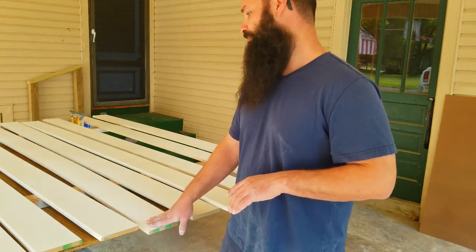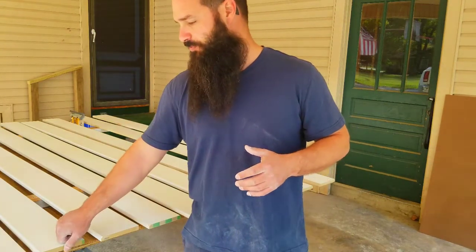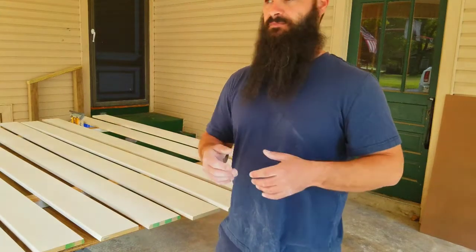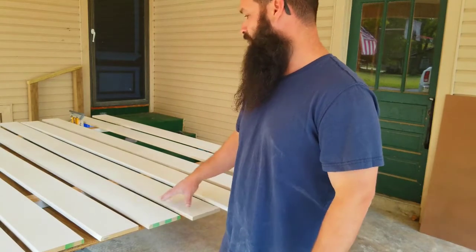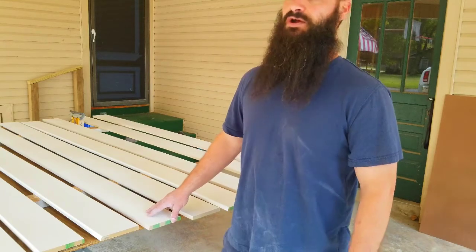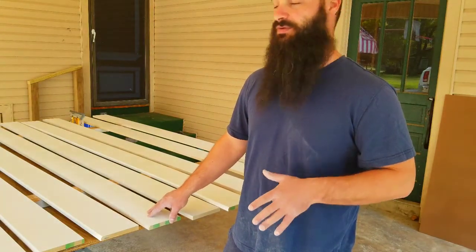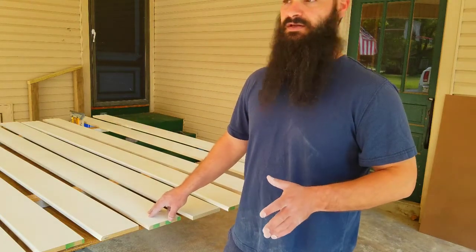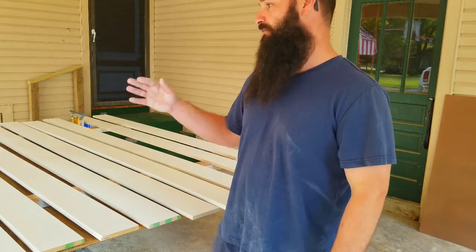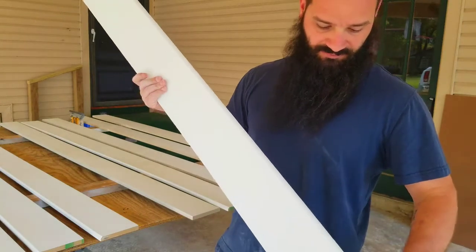I left the cut edges untreated because I'm going to wood-glue them — they're eight-foot strips, so on a 12-foot wall I'll glue pieces together. I used to use biscuits but they'd swell up — that's another video. Key takeaways: sand off your orange peel, sand between coats if you want a really fantastic job. If you're using a sprayer — I'll do a video on that next — there's some finessing that makes a big difference. These thin primers go on like a dream. So far, part one of two — we've brought raw MDF to a really good-looking craftsman trim and I'm happy with the profile.